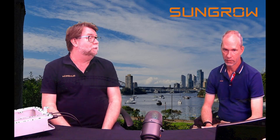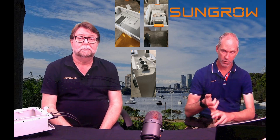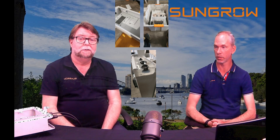In particular, this time we're going on the SBR range. Warren, you've done a lot of tests on these. Could you maybe tell us how you've tested them and what you've found? What we have found is some batteries coming in with water intrusion, and basically they're flooding from the inside. I've gone through and I have submerged the batteries, shown here. I've also submerged sections of the batteries — basically submerged everything. There has been no water intrusion.